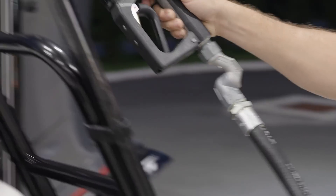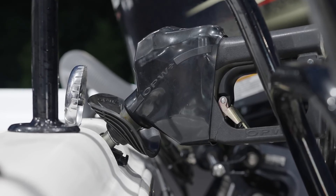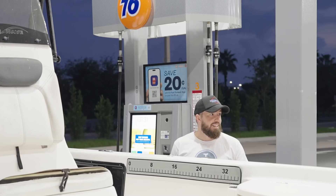Some motors do even better than 15% — it depends a bit on the setup. The way we accomplish this is by optimizing the fuel mixture and spark settings, which makes the engine produce more torque. Torque is really what's driving your boat forward. Because it's making more torque, you can be driven just as hard and as far at a lower RPM range. The engine cruises at a lower RPM, and that directly translates to fuel savings. Efficiency translates to horsepower, torque, and better fuel burn.